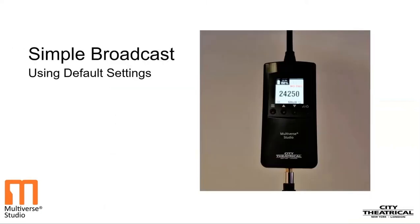I'll do a simple broadcast using the default settings. Let's send some data to our Multiverse Studio Receiver. I'll plug it into a lighting fixture and turn it on. I'll use the Multiverse node as a transmitter. All we need to do is make the SHoW ID, universe, and optional SHoW key match between the Multiverse node and Studio Receiver. I'm using the default SHoW ID of 24250 and the default universe 1.